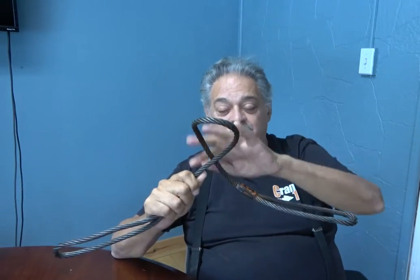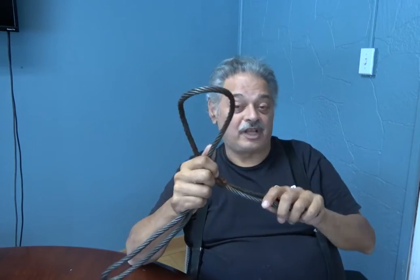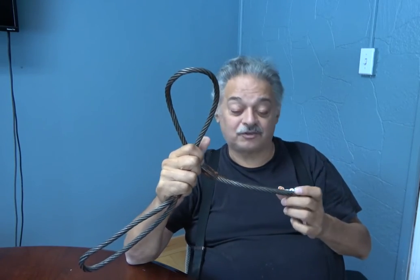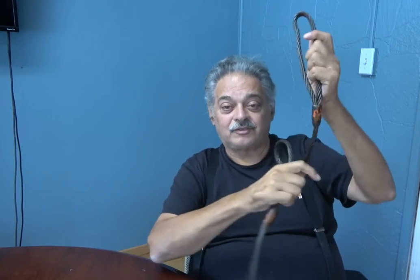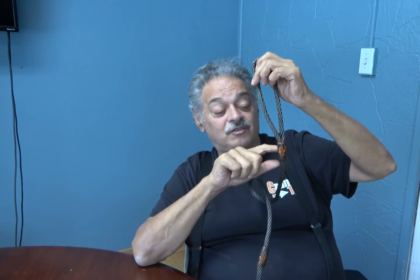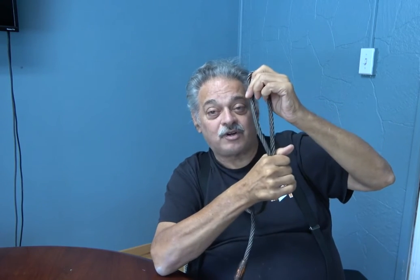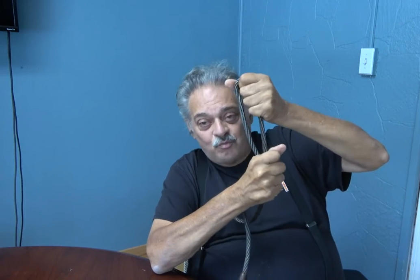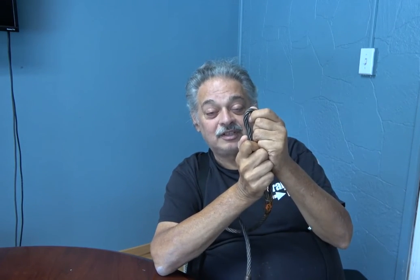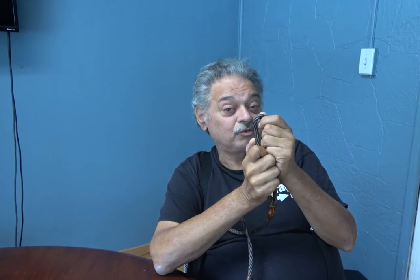Now you can see this wire rope sling — it's made out of a standard lay rope, but a right lay rope, six strands. The eye of this, and one of the reasons this eye is so incredibly strong, is that the rope has been separated and woven back into itself, so the ends of the rope are underneath this collar, which then gets crushed onto the end. So the harder you pull on this eye, the tighter it pulls on itself and grips, so this eye isn't going to pull loose.